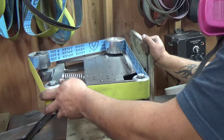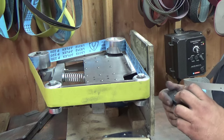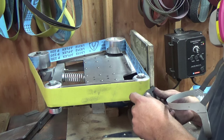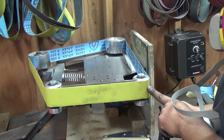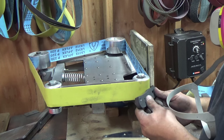So, all right, we're going to start off with our finger relief. And this is going to be a little different than the first contouring video that I showed in the How to Make a Knife series. I'm going to do it all by hand, all freehand. And we're going to take the 2-inch wheel that comes standard on just about every grinder out there. And we're going to grind like we're grinding a blade.